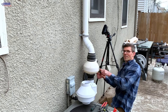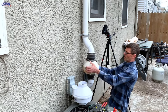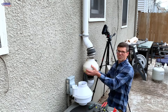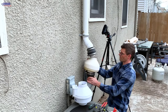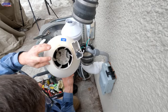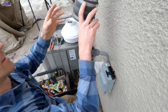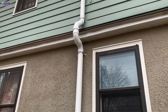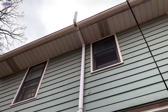The customer did buy this house about a year ago and did not do a radon test, so I just threw an eco tracker down in the basement — gave her one to plug in — and we'll have a good idea of what the radon levels are with this current setup before we leave. I have a critter guard on the top, and it doesn't look like we got a ton of debris in there either. There's not really any big trees over it, and it's got this weird jog where it goes up around back to the house and then up and around again — a little goofy in that sense.